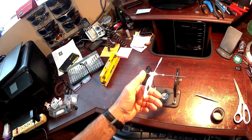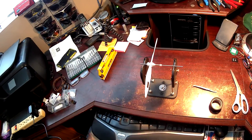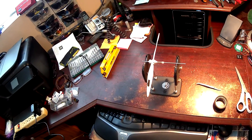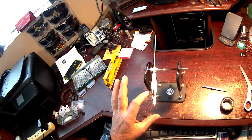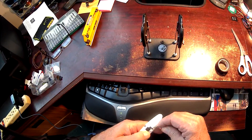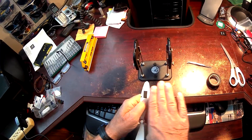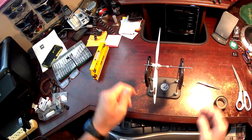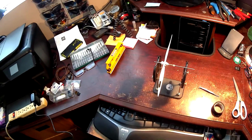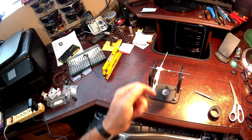Let's try the horizontal again. Horizontal is showing heavy on that side. The far blade on that side is heavier — this also shows that side is heavier. So we've got to move this one out further, trying to maintain the same distance from the edge. I moved it out but I didn't move it back and forth any, so let's see if that's going to make it any better. Not too bad — let's check it this way.